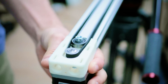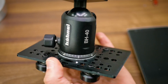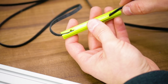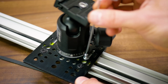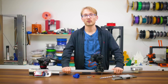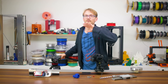Next, mount whatever tripod head you want to use to the moving plate. I used a simple ball head to quickly adjust the camera angle, and three screws instead of a ¼-20 thread to mount it — because it was just easier — but you could go with the tripod thread depending on the exact head you want to use. Now would be a good time to cut the belt to length; mine is 7 feet and a quarter inch, or 2 meters and 14 centimeters long. The belt gets trapped in the printed belt holder before adding the open belt's plate, then gets screwed to that plate. This was the trickiest part to design since the fit is really tight and requires a bit of trial and error to get it perfectly aligned in the slot without rubbing. The last finishing touch is the mounting plate, which you'll use to attach the slider to your tripod. I used a cheap Manfrotto-compatible plate, drilled a few extra holes and mounted it to the bottom of the track. The most important thing is to use a good and sturdy tripod — I've got a 9001 model with the Manfrotto head, which is plenty strong for the setup.